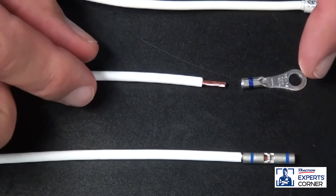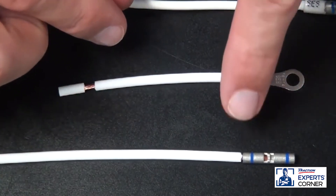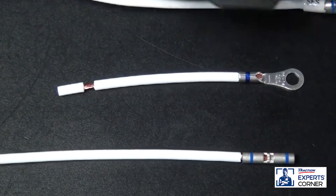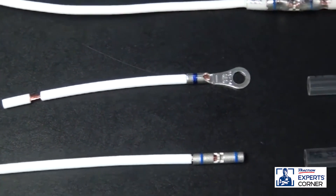The window and the 45 degree barrel ensure that the wire is stripped to the proper length and fully seated. The color stripes on the crimp barrel indicate the wire size, where to position the crimp tool, and it also matches the crimp nest on the installation tool.